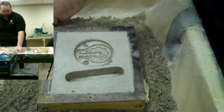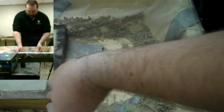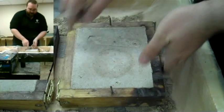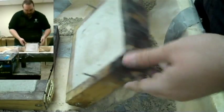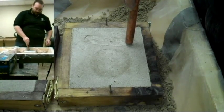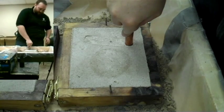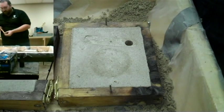Now if you look at the other side of the mold, you can see the mark of the sprue here. Get the mold flat. I use a copper pipe and we are going to cut a pour hole straight through. Make sure you support the other side of the sand when you do this, or that will break your mold.